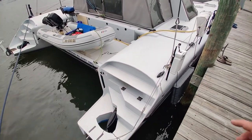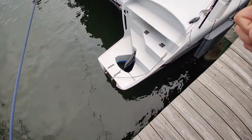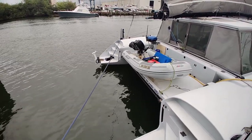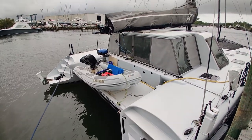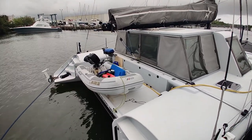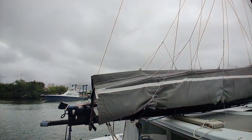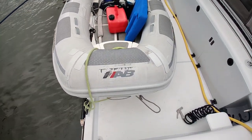She is real sleek. Looking at the sugar scoop first, you're going to notice you've got a pull-up rudder — there's your cassette and you can just pull the entire rudder up. That little contraption at the end of the other sugar scoop is actually a hydro generator. It's not a motor — this isn't an electric boat, but you can use that to actually generate power. The aft section of the boat is a platform dedicated to the dinghy. You can pull the dinghy up and down using the boom crane, which extends on the end right there — just run the topping lift through and you can pull the dinghy up and down. It's got an Italian AB dinghy.